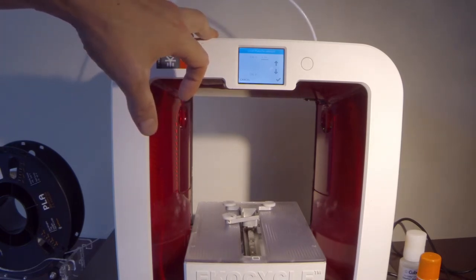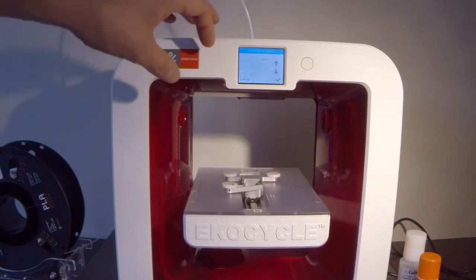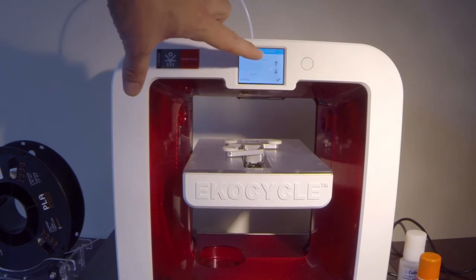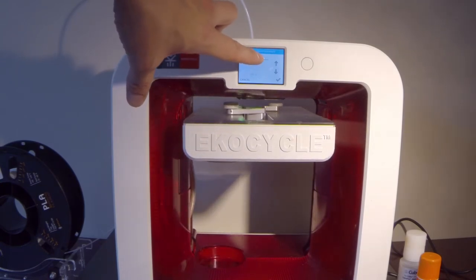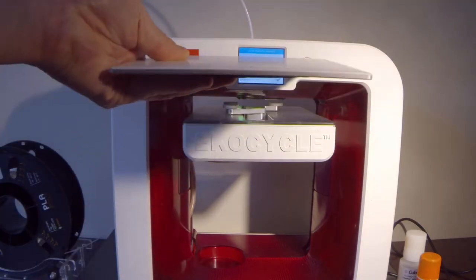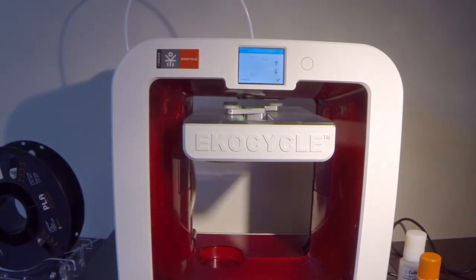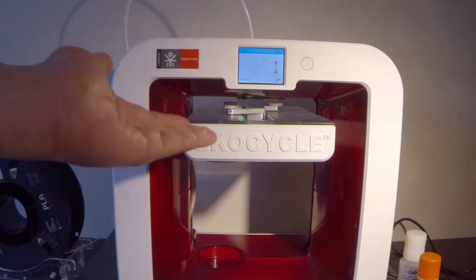Give this a second here. I pull the plate off because if the previous user had this calibration one number set like off the charts, your print plate will ram into the bottom of your print tip. And it actually did this on this very printer. That was actually set to over 8, so it's -8 something. Ran into it,